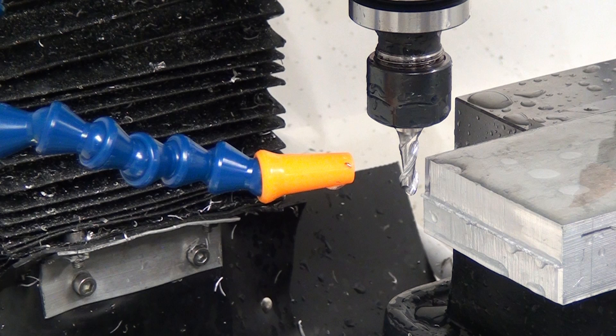My favorite part of this end mill is that it's eight bucks — eight bucks plus shipping — and you are gonna have a very high performance end mill. I've broken a couple of these from crashes and abuse, but I have not worn one out. They are razor sharp, they give a great finish assuming your machine isn't vibrating, and chip evacuation is fantastic. I'm going to show you three different cuts: a 15% stepover, 30%, and then a full slot.